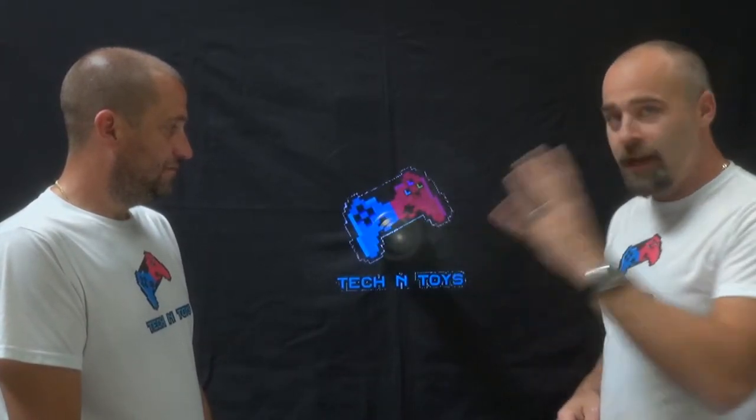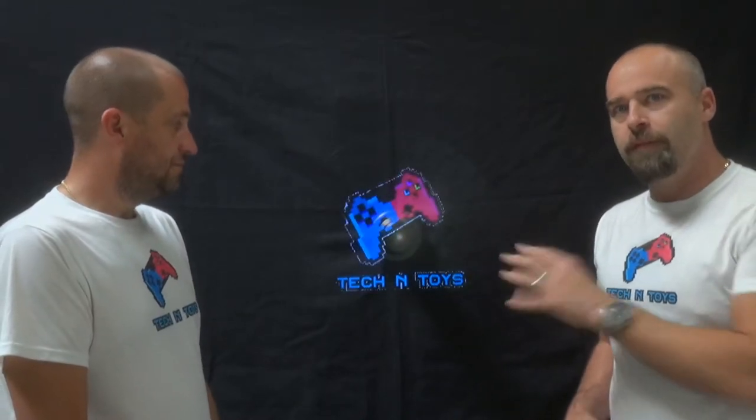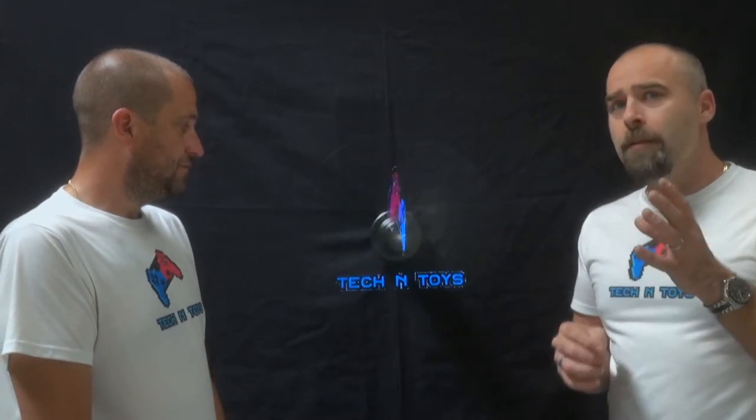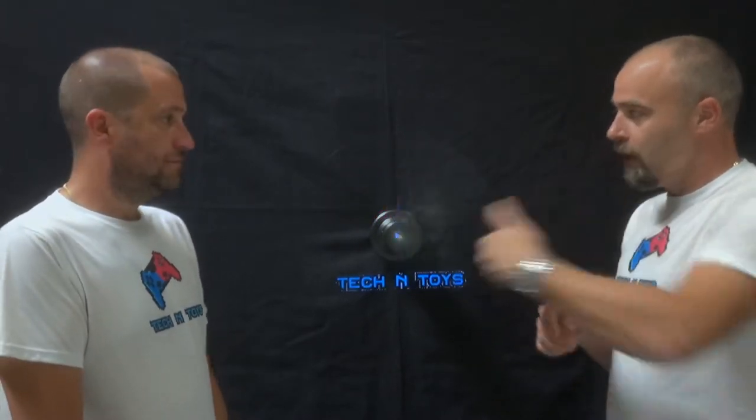The only problem, compared to something like HyperVSN, is this isn't spinning at enough speed. It's also only got two blades, whereas the HyperVSN has four blades, giving twice as many pixels. You will see it flickering ever so slightly in the shot — you don't notice it quite as badly in real life, but a camera picks it up quite badly. We've actually had to adjust the shutter rate of the camera to compensate, because on automatic you see a lot of missing parts of the image where the shutter rate isn't matching up with the number of rotations.